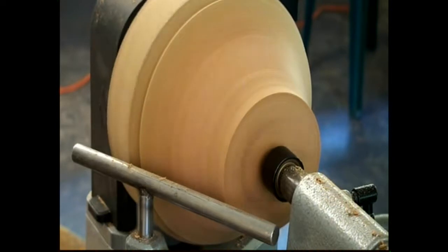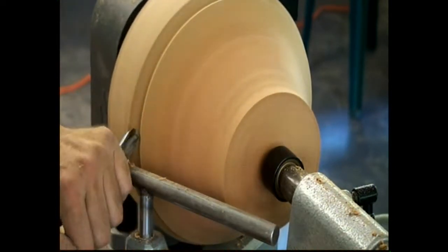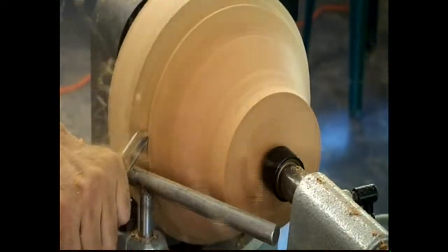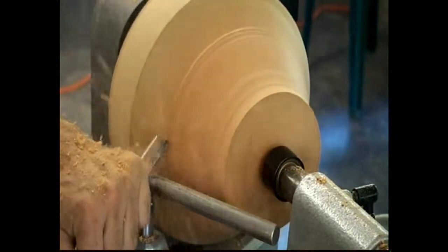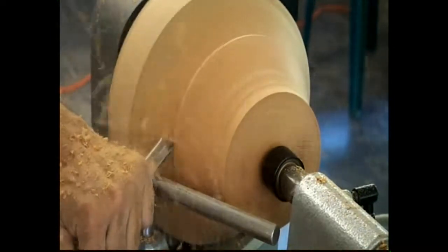And if you do make one of these, do not make that be side grain. End grain only. This could break off real easy. In end grain, it won't break. But actually, if you want to do that, you can make a dowel that's end grain in side grain. Oh, yeah. Well, you can do that as well. And there's always a way.